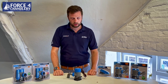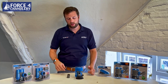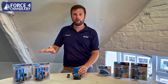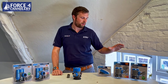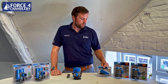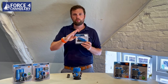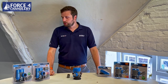The auto pumps come with a three-year warranty, which is really nice. Camco have put a lot of work into designing the switch and its reliability, and they back that up with the three-year warranty. The manual pumps come with a one-year warranty — there's very little to go wrong with them. The auto switch is also a mechanical float switch: when it rises to the up position it turns the pump on, and when it drops back down as the water level falls, it turns the pump off.